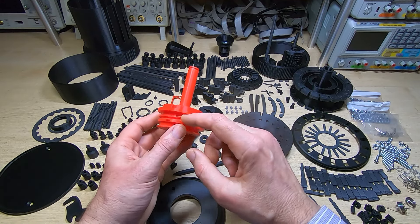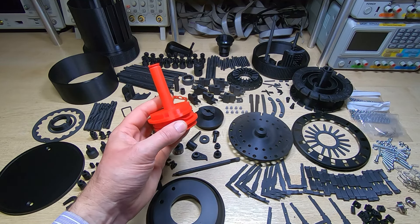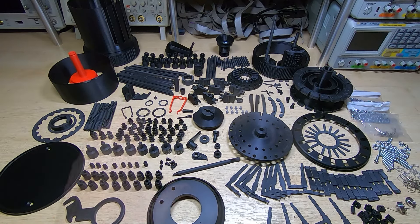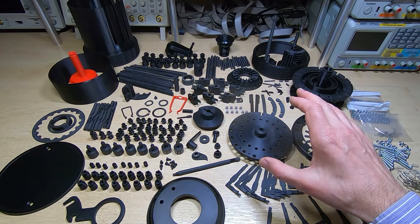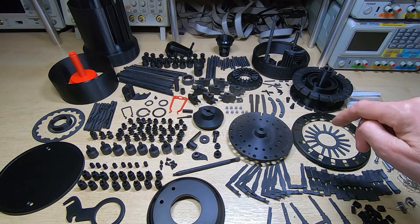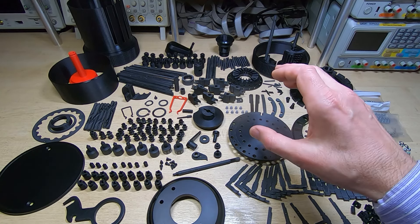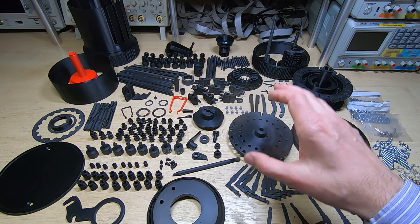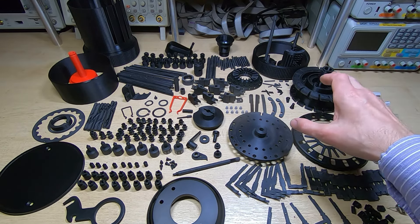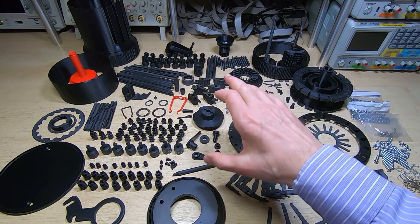Some parts it's important that the mating surfaces — the working surfaces — are very clean. This part took quite a lot of finishing: the ramps here, for example, the contact faces need to be very smooth so they don't snag or grab the parts that slide on them. It's about getting parts to the right dimensional tolerance and surface finish that's going to work well in this calculator. When you turn the crank, a lot of parts will all be moving at the same time, so even small amounts of friction that seem insignificant may well cause a problem once all the parts start moving together.